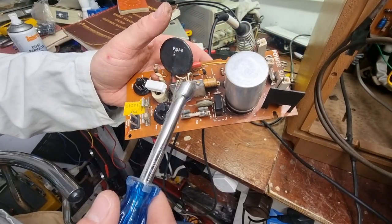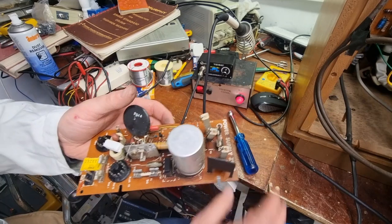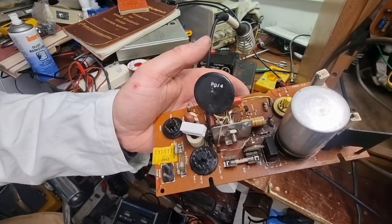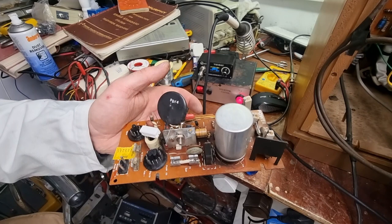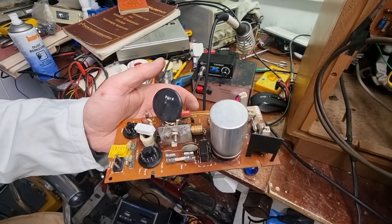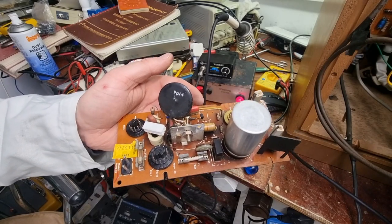There you go. And this vibrates, you know, so they actually come loose just with the 50 hertz vibration of the mains over time. Much similar probably to the way I'm sure some of you who are in the trade will have noticed that the neutral pin and wire in a plug top always seem to come loose with hilarious consequences.